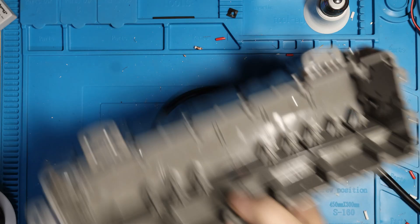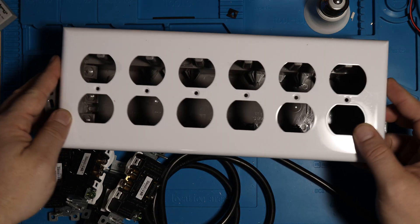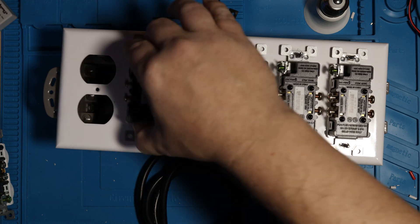Next, I'm going to create my 12 Plugs of Christmas box. I need to plug in a bunch of little light strings for a half-size tree, some lights around the window, some lights for small decorations on the sill, and probably some other accent lights. I've had this six-gang box for quite a while. The original purpose was going to be demonstrations, but that was dumb and didn't work. I wanted to use the solid core wire from earlier because this box has more depth and will be more forgiving. The first thing to do was set the faceplate on the box and set the outlets on it facing in, so I can more accurately get an idea of wire lengths and assemble everything sort of imagining the box around it.